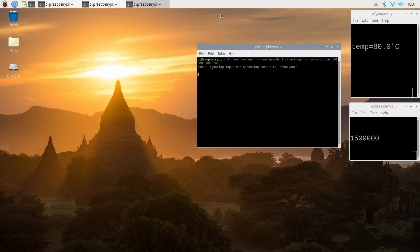Then I opened up Chromium, ran a 720p video for five minutes, did some web browsing, and tested thermals on both of those. I also extracted a Raspbian image — it's 1.1 gigabytes. And finally, my extreme test: I used Sysbench to totally max out all the CPU cores. Within four minutes without a heatsink, we're already thermal throttling at 81 degrees Celsius. You can see it blinking up here — so this is with no heatsink. I've already recorded all of my thermals without a heatsink, and I'm going to put them inside of a chart along with all of the other ones you're about to see.